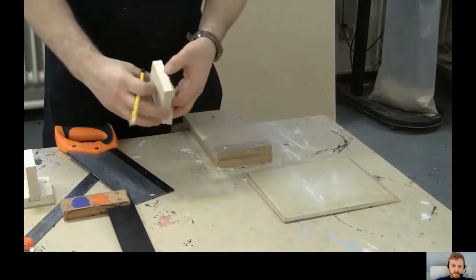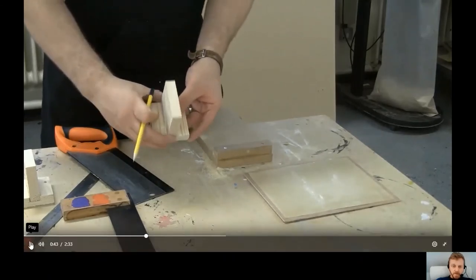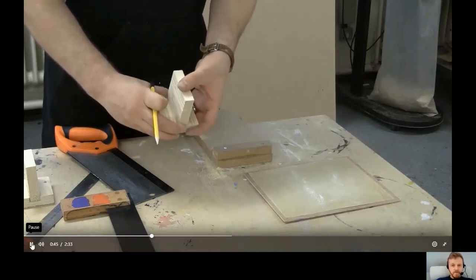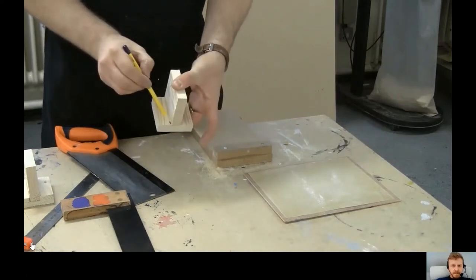At this stage, use one piece of wood as a template for marking the other piece, so you get exactly the right thickness. Place the wood along the grain — the lines running along the piece — and position it on top centrally. Hold it in place with your thumb, then mark either side of the piece of wood.